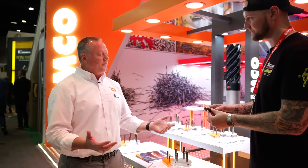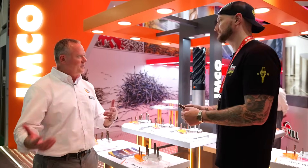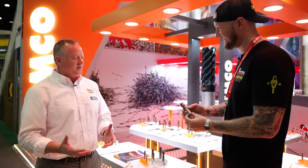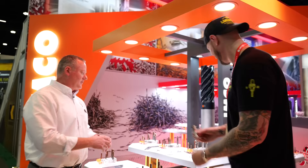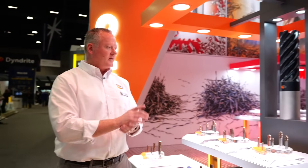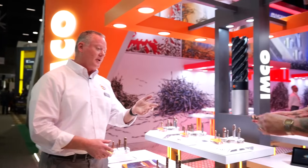Absolutely. A four-flute end mill is supposed to cut everything from soup to nuts — it's supposed to be your general purpose end mill. That four-flute will be able to do that, but it'll be very aggressive. Where you take the newer HEM toolpaths that everybody's running, there are some limitations — maybe it's a shallow feature, or if you have a slot or an entry move that's not very wide but is pretty deep, that four-flute end mill is going to take that straight zigzag, very tough ramp — 30 degree, 45 degree ramp, no problem. We see that a lot in the firearms industry, and that's really going to be very helpful for that.